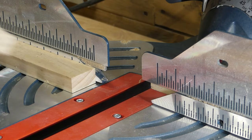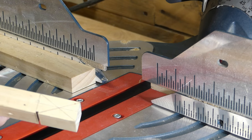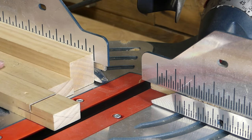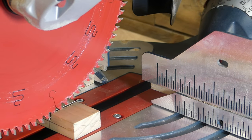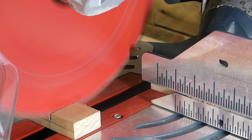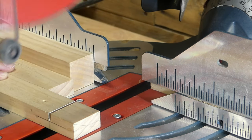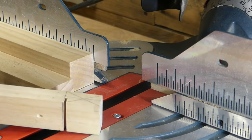The spacer was not quite big enough — the blade went through but did not go all the way through because the sliding motion didn't go back that far. It's a quick adjustment. I tried a couple of times and set up a few more pieces of scrap wood as a spacer, and now it looks good. I'll run one more sample cut all the way through and take a look — pretty sure everything turned out all right. Looks good.